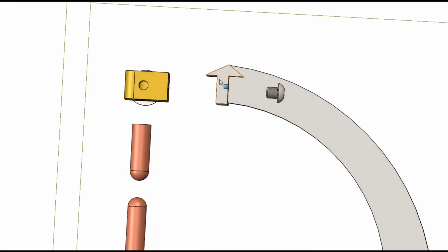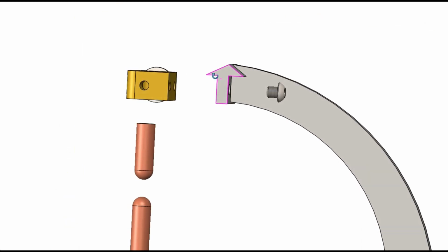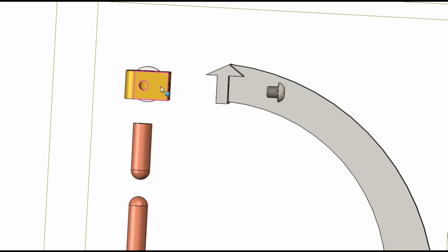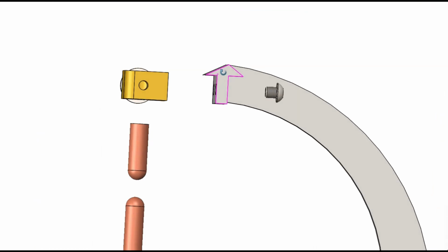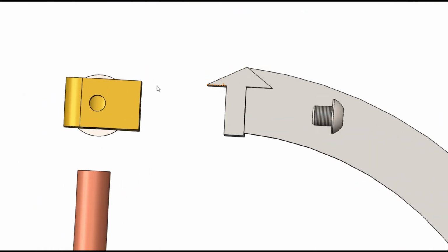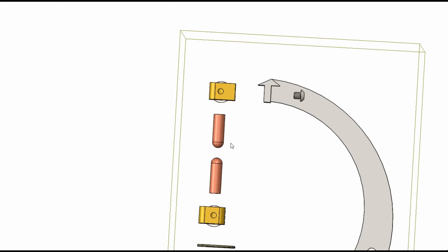This arm is designed to be complex and very narrow here at the top to fit into complex areas. This brass block doesn't just depend on these bolts to hold it when pressure is pushed against it. This 6mm overhang here is designed to rest tight here, so any force applied hits this outer tip rather than straining the bolts. It works really well.